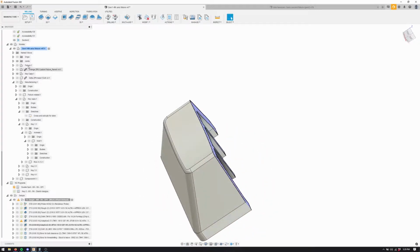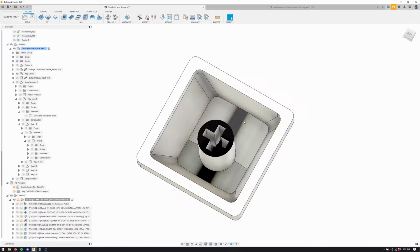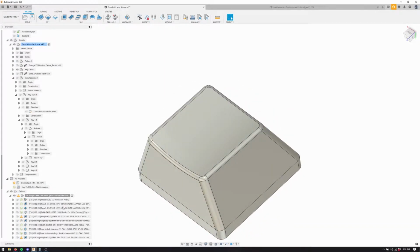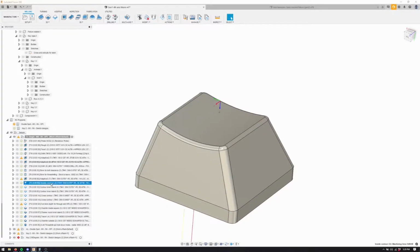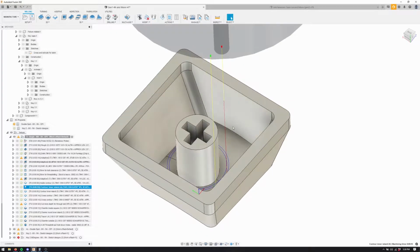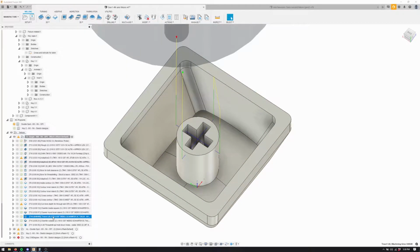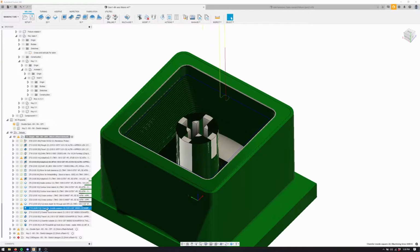Essentially, I'm just cutting material away from the front here down enough flat, so if I want to cut through here in the op 2, which we were going to do, that's kind of the only way to get enough material removed, is to do that contour, because the adaptive does not completely rough it out. Plus it thinks the model is curved there, so it won't flatten that area. Yeah, okay, so there's that, and then we just have our chamfers.